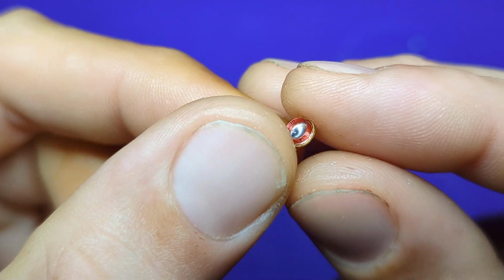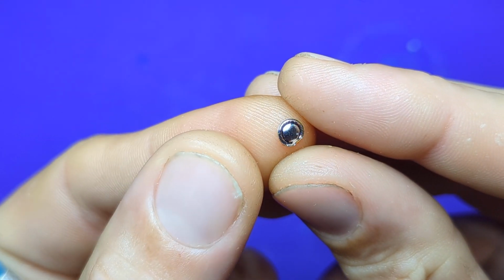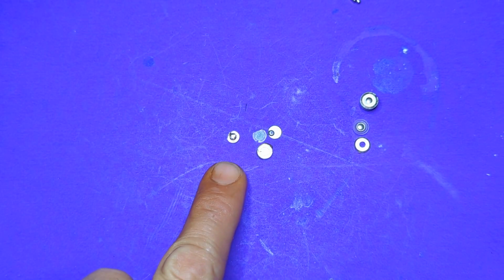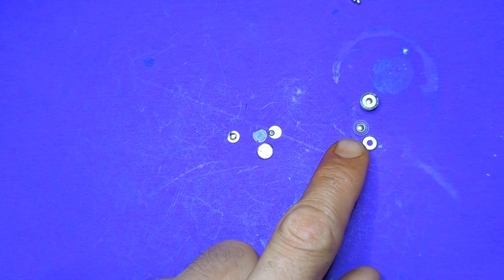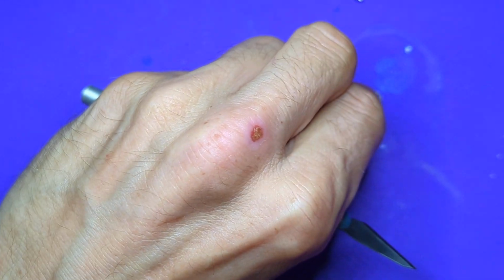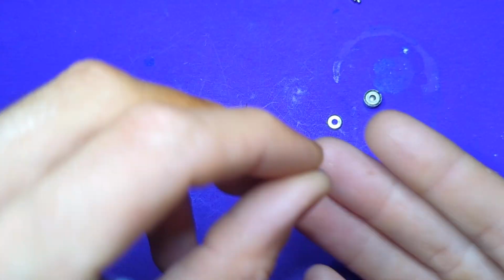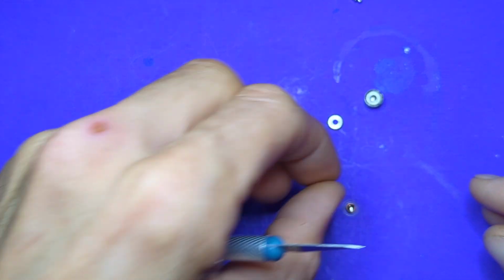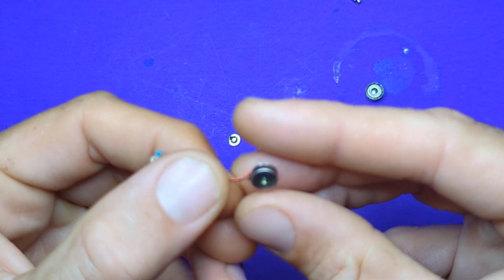But these make great tweeters. They really do. But yeah, so this is like the traditional technology, this 5mm beryllium driver. That would be your traditional type of tweeter, and then your flat panel tweeter, and then same thing with this driver. You know, you get highs out of it, but this is your full range dynamic driver. Same principle, but the coil is perpendicular. It's not flat and parallel with the diaphragm.